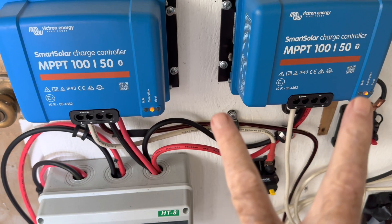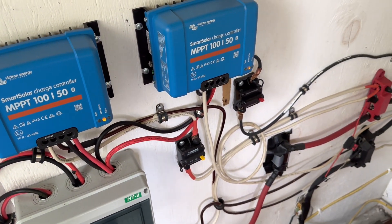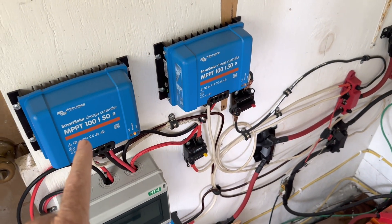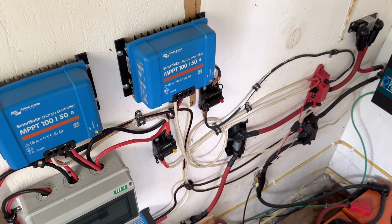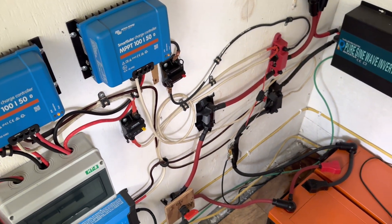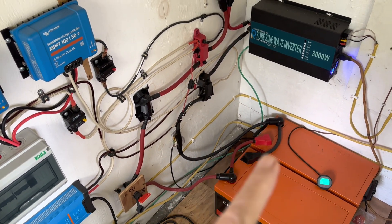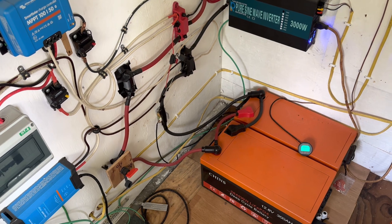These lights will turn green in just a minute. I'm really glad I made the switch to the Victron too — I use Victron now on every system I build. It's just another plug and play. They have a lithium iron phosphate setting pre-programmed in these charge controllers that takes it up to 14.2 volts during absorption phase, then kicks it down to 13.5 as a float. Once you get to a full state of charge it lets it settle to 13.5. If a load draws it below that, it'll open the solar panels back up and maintain at least 13.5, which is still a full battery.